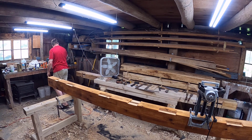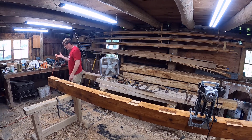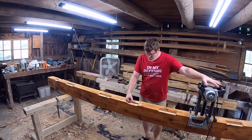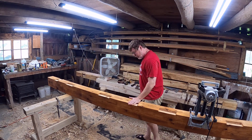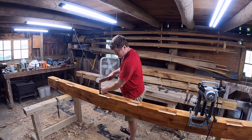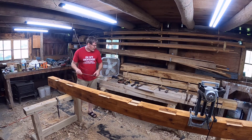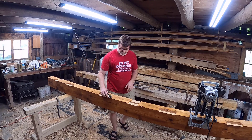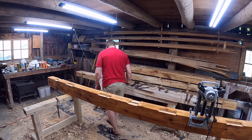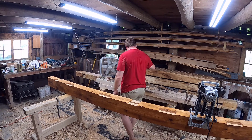You'll notice I've got all my power tools lined up on this side of the bench. I'm a little short on electrical outlets in the barn, but I have one extension cord that I plug and unplug those things. The other extension cord stays permanently connected to the chain mortiser because I use it quite frequently. With things cleaned out with the chisels, I use framing squares to check for one and a half inch depth and check my mortise depth and layout lines. Some reference lines are two inches so the other leg of the square comes in handy. I clean up edges with a block plane, or use the larger plane for heavier clean-up to square up the reference faces on the posts.